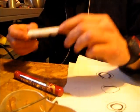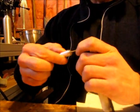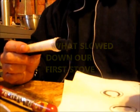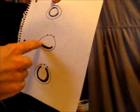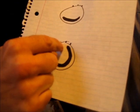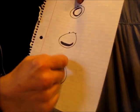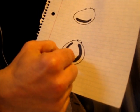The second thing we had to deal with was the felt inside. Originally I had rolled a piece of felt that was bigger than one revolution — about a revolution and a quarter — and it overlapped and slowed down the flame too much. We experimented with a full revolution of felt, and also with just a little bit on the bottom just to absorb the fluid so you're not spilling when you're trying to prime it. What I found is that a piece of felt that wraps the entire tube and ends before the jets is where it's at. That way when the alcohol is sitting on the bottom it can still boil up with a little bit of pressure. If you close it off all the way you need to increase the pressure to get it out, which affects the prime and boil times.